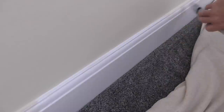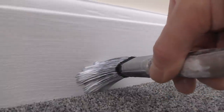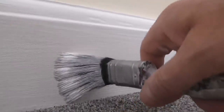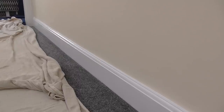If I was using a two-inch brush there's no way I'd be able to lay it off as neat — that's the trick to getting a really good finish, laying it off really neat. When it comes down near the carpet you're always just working up to it; you never go straight to it straight away — let the paint on the bristles just slowly work down, always laying off the paint and closing up those brush marks. That's the undercoat on now.